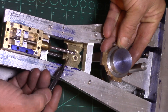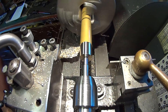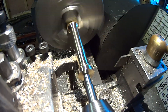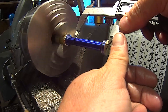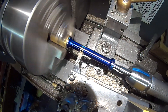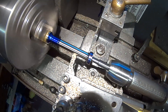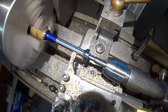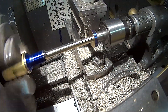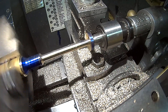The eccentric now needs connecting to the valve stem via a connecting rod, so a length of brass was turned to reduce its diameter for the conrod coupler, and then further marked out for the main stem and reduced further to suit my design. The end which connects to the eccentric had the radius turned off to allow for connection with the fixings and then the rod was parted off to length ready for milling.